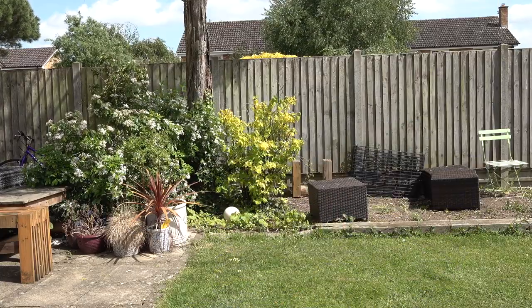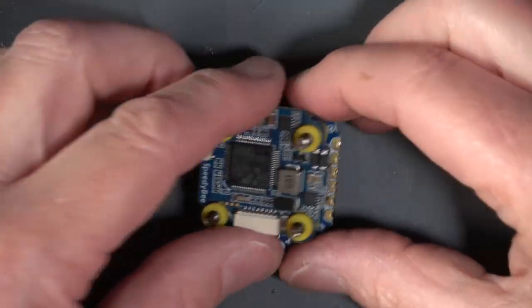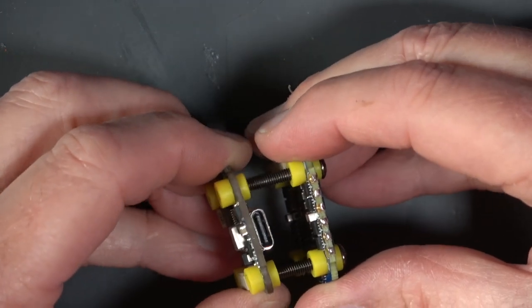My immediate thought was the flight controller is badly mounted. And if you get little twitches like this on any axis, this should be the first thing to look at. Have you correctly soft mounted the flight controller with all the gummies, and have you got a good quality low ESR capacitor soldered directly across the battery input? These reduce the mechanical and electrical noise getting onto the gyro chip on the flight controller PCB and messing up the PID loop, which can give you those little random twitches. Also, it's worth checking the flight controller is free on its soft mounts and not squished in the frame or catching on anything.